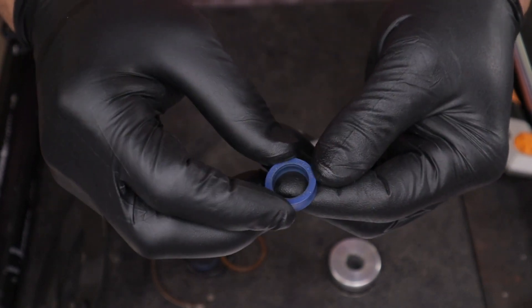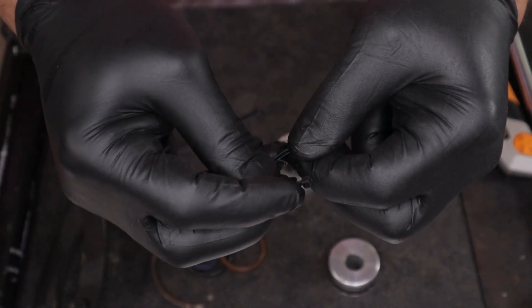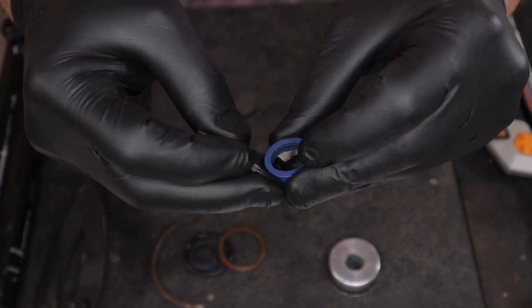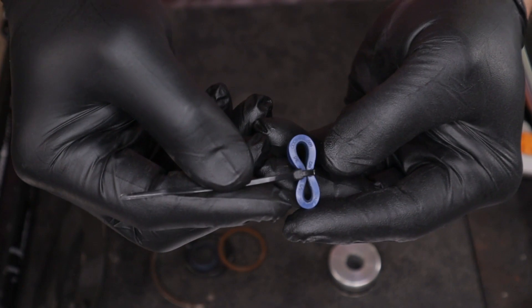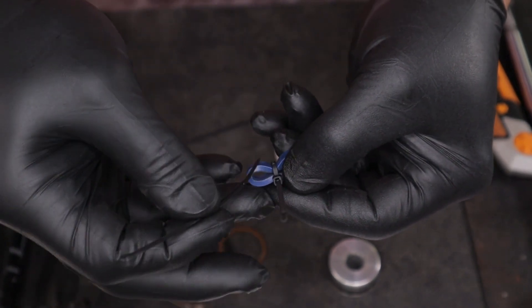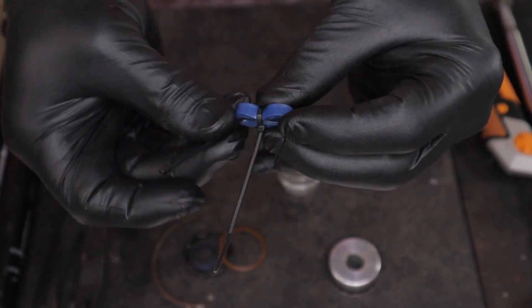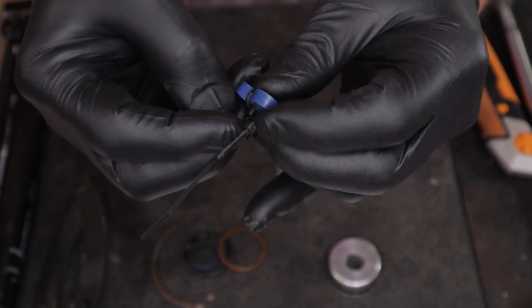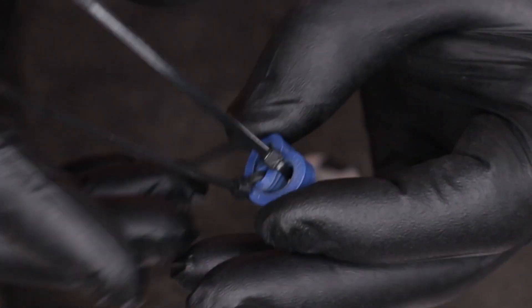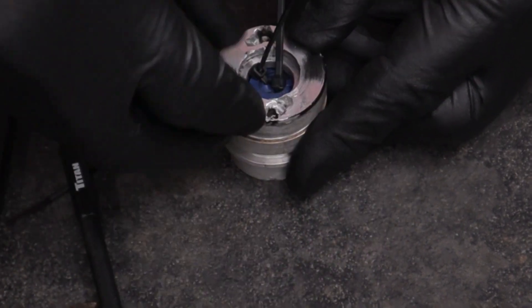Replacing these seals can be a little cumbersome, but here's a quick and easy way to get the seal back on the gland nut using a couple of small zip ties. Fold the seal in half and zip it down — not too tight, you don't want to crush the seal, just hold it in place. Then run another zip tie through one loop, swing it around through the other loop, fold the seal in half again, and zip it down. This compresses the seal small enough to just pop it right in.